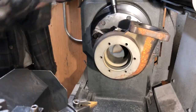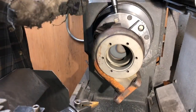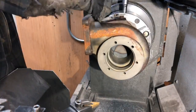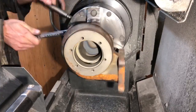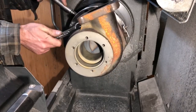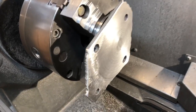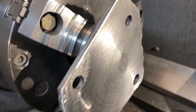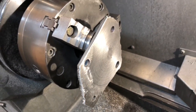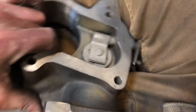The welder that I use for this job is a Miller-Matic 211. In this job I use a 110 plug on it, and I put the settings right below 3/8 to be able to weld the pipe to the plate. I didn't completely max it out because it's on the 110 power, but it works perfectly like this. I prefer to use 220 when I can. I just don't have a 220 plug near the lathe.